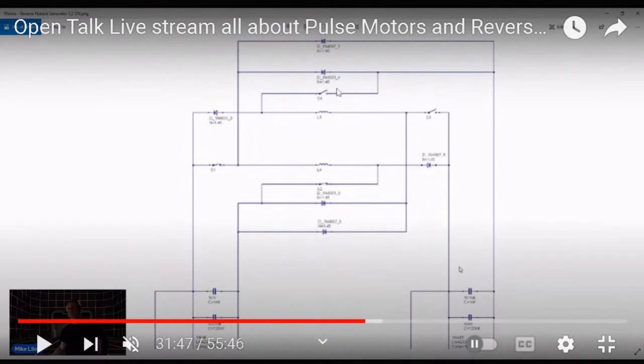These two switches control this inductor. This is the positive rail to the battery, and that's the negative. So your flyback goes this way out the high voltage diode to the other battery. And the negative of the flyback here goes this way to the other battery. You're just directing the flow of current where it's going.